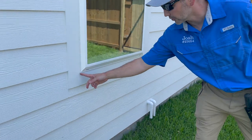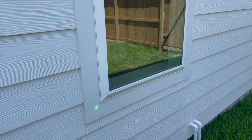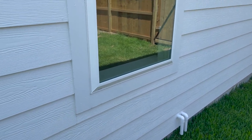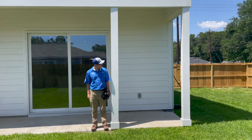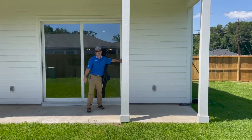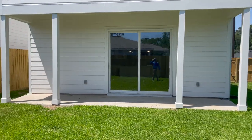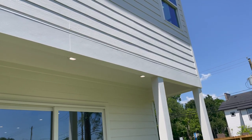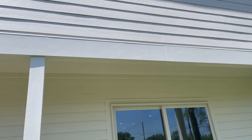The bottom looks correct too, with joints going down instead of across. What they do is lay the trim all the way across — the trim board is supposed to go all the way down so the siding can shed water properly. This looks really good. Josh spotted a crooked post walking around the exterior — you can compare it to the door to see how crooked the support post is. We're going to write that up and recommend repair. The Hardie transition here with Z flashing added is exactly how it's supposed to be installed to shed water properly.